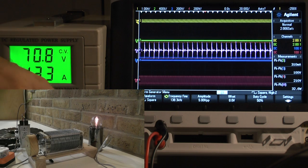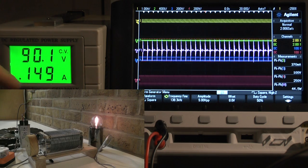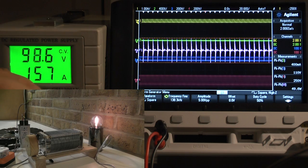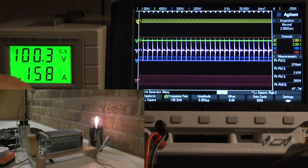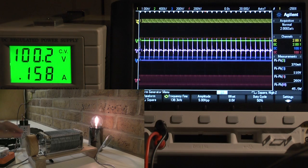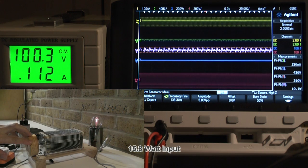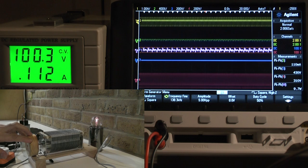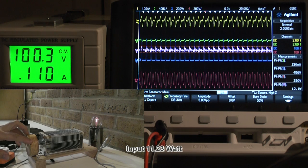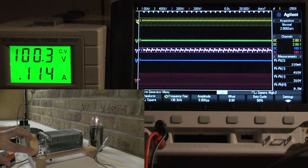Running from the amplifier, going up to 100 volts — you'll see it on the second camera as the lights come up. I'm at 138 kilohertz at the moment. At 100 volts it calculates 50 watts output. Now if I tune slightly, you can see the output is lower on the load side and also the output is lower on the input side. If I turn it a bit further, it drops.